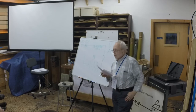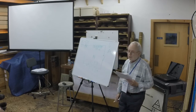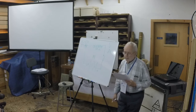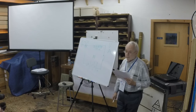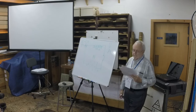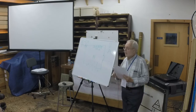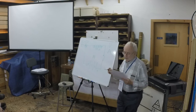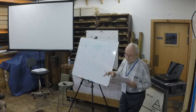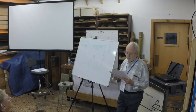So to work out how much current is needed for the playing action of an organ, you just figure out how much current each magnet needs and multiply that by the maximum number of magnets you might expect to be played at the same time. A sensible number, of course. At some point, you're going to have to decide how much electricity to provide. I use that rule of thumb I mentioned that doesn't often get me into trouble, based on playing 10 notes on the manual, on a keyboard with all the divisions coupled.